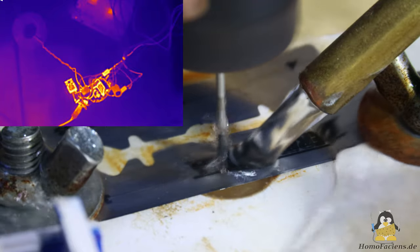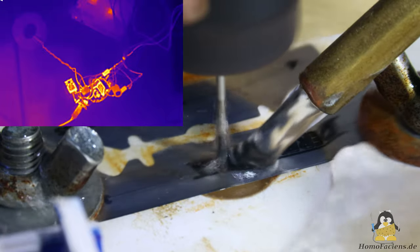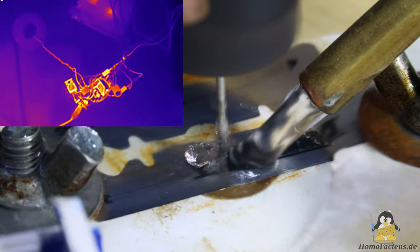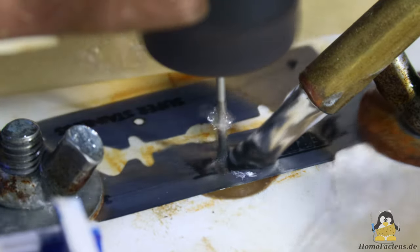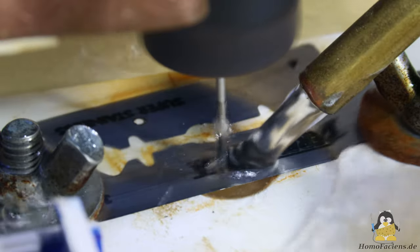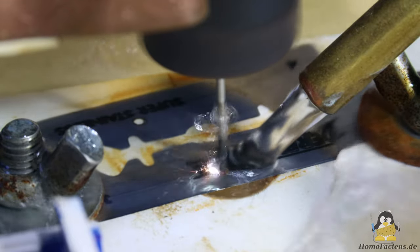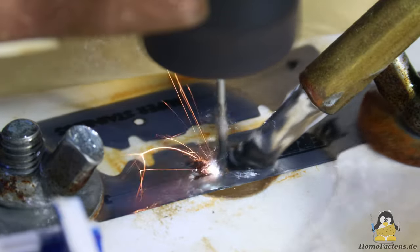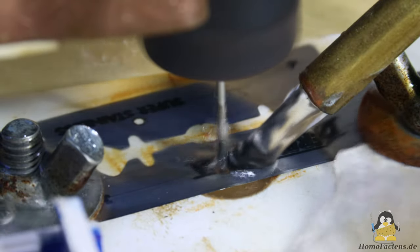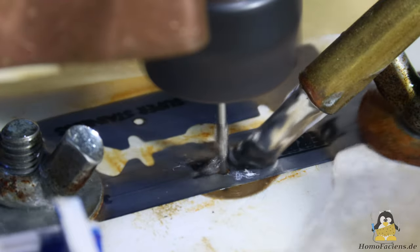The thermal imaging camera makes the switching losses of my all too simple electronic design clearly visible. The MOSFETs are shining in bright colors. However, the coil stays completely cool, at least in this test run. I will report in more detail on the subject of switching MOSFETs in a later chapter. For now, just keep in mind that this isn't as simple as it sounds. The target voltage of 40V is easily reached; the electrolytic capacitor cannot withstand a much higher voltage. With this setup, the bore is completed in just 60 seconds and 245 shots.